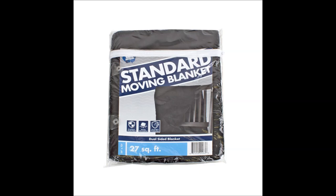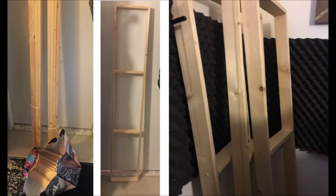The first thing I needed to do was create the wood frames. I decided on one inch by three inch posts. I would need eight posts for two sets of bi-fold panels. Home Depot offers six foot high posts which was the height I wanted, but I figured out that by purchasing eight foot posts at a lumber company it would be cheaper, because I'd have 24 inches left over from each post to create the 12 inch crossbars I would need for each of the four panels. Plus, unlike the Home Depot in Manhattan, the lumber company offered to make the cuts for me at a dollar a cut.